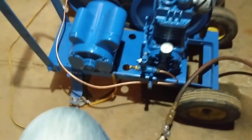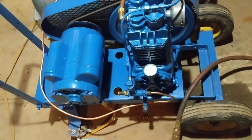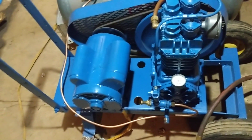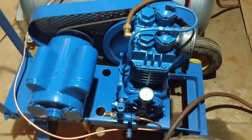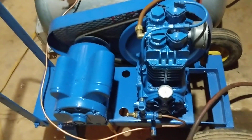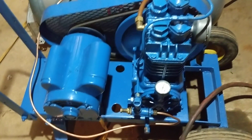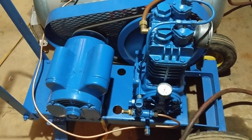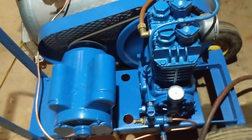So I just wanted to show you this rebuilt compressor - it was a pretty easy job overall. I didn't even take apart the oil pump because I read it's not good to disassemble the vane-style oil pump since you'll never get it back together, and I didn't have parts for it anyway. That was the only thing where I followed the 'if it ain't broke don't fix it' rule. Everything else got addressed - the cylinders were glazed and worn, needed a fresh hone, and the rings were in bad shape. It had a cast iron oil control ring, and the new ring kit came with a three-piece oil ring set, which should help with any oil consumption issues.